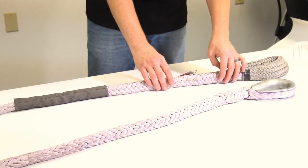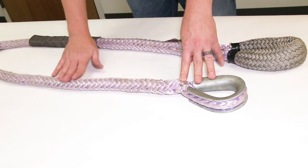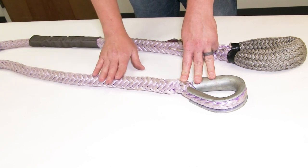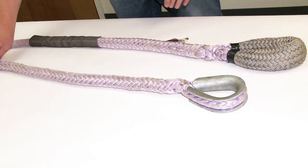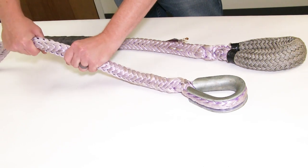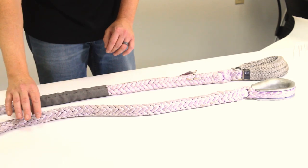There is going to be a gain in diameter at the eye. So if we have a one-inch sling, it's going to be about an inch and a half at the base of the eye and then come down to one inch. That's something you need to know so it doesn't throw alarms. But if you've got a change in the construction or the diameter, you will see twist in the rope — actual twist, pretty clear to see — and probably a distortion of the rope.